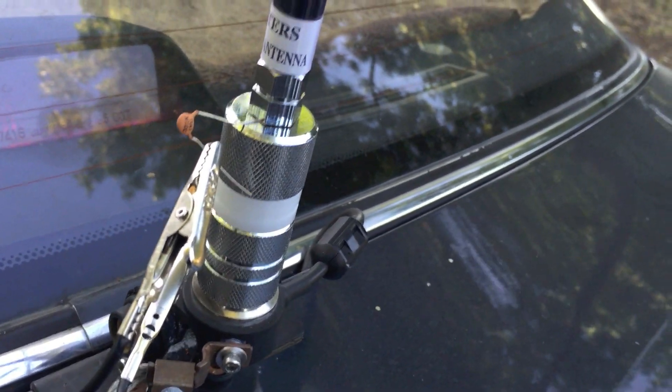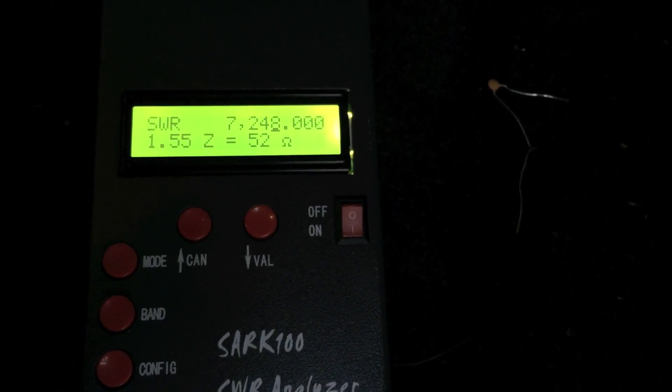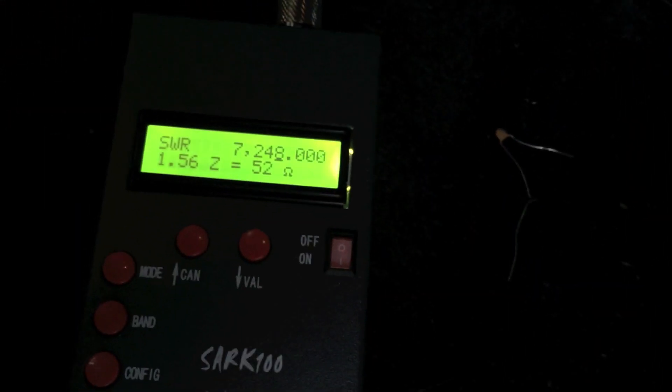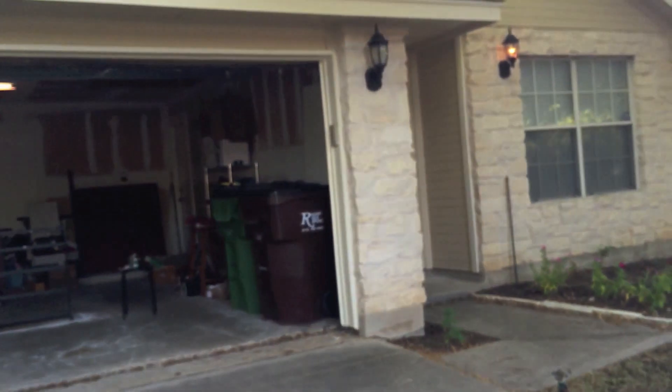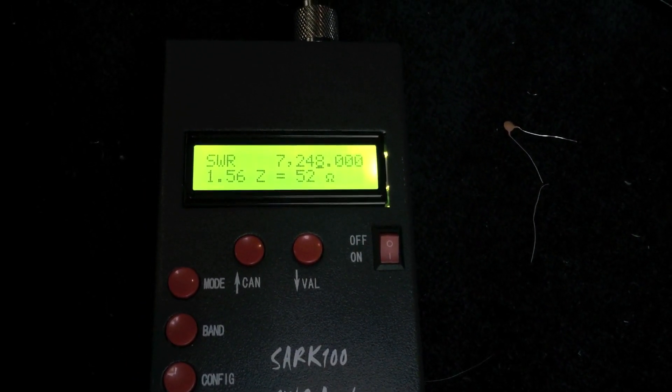Online people were talking about 400 to 500 picofarad capacitors being appropriate. This 330 seems to be the best option. According to my analyzer, I'm now getting 1.55 to 1, which actually in itself is just fine. I'm dubious about this analyzer's accuracy though, so I'm going to use my SWR meter to do a double-check to see where I'm actually at. Being in my driveway next to big buildings isn't the ideal place to check your SWR — I prefer an empty parking lot — but I'm going to wire this up to my SWR meter and transmit at very low power and see what happens.